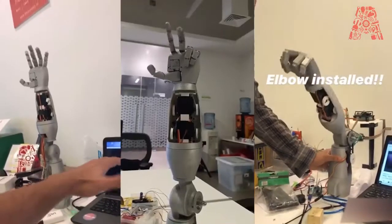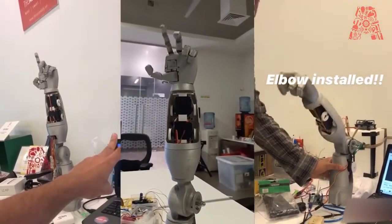This project was fully 3D printed. It took almost two weeks to print all the parts, and we ran into some trouble because not all of them were fitting the standard local servos. After putting it all together, we used approximately 6 to 7 servos because each finger had a servo allocated to it, one servo for the wrist rotation, and another servo integrated later for the elbow motion, which needed a bigger one because it would be driving a lot of weight.